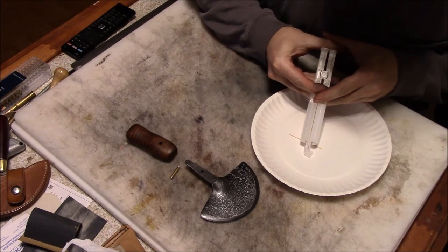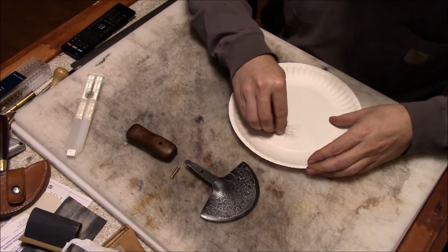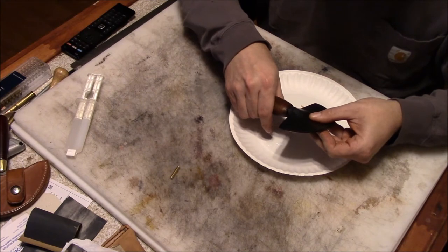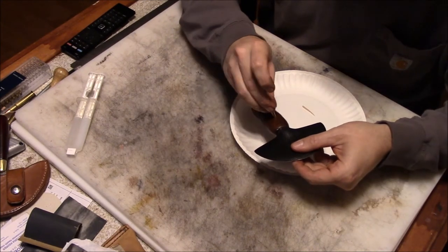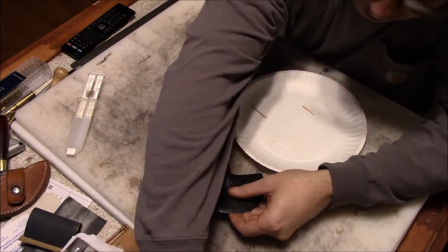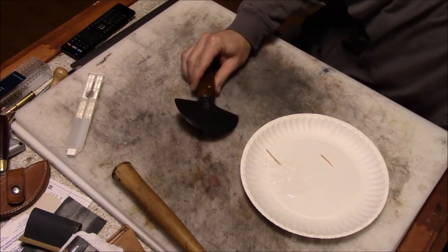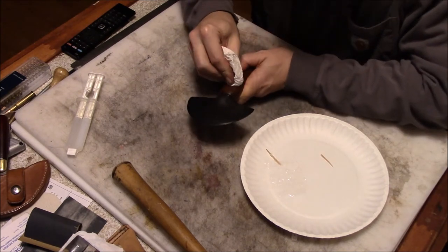The blade's out of the etch. I'm going to take some epoxy — this is just regular five minute epoxy you can buy at any hardware store — and mix it up and get it into the handle to glue everything up. I made sure my pin fit before I did this. I've got a little brass pin there and made sure it all fit together nice and neat while dry and not too much of it stuck out before I mixed any epoxy. So we're just going to take that pin, put some epoxy on it, slide it in there, and then take a mallet because it's a tight fit and tap it on in. Make sure it's all together. Clean it up — any epoxy that's squeezed out you want to get it right now while it hasn't started to set. Clean up around the pin holes and where the bolster meets the blade.